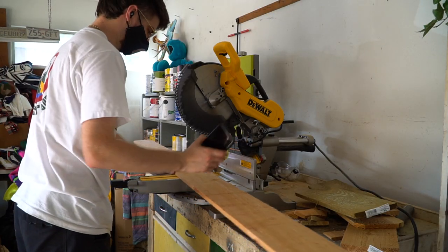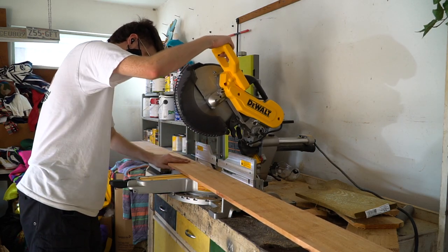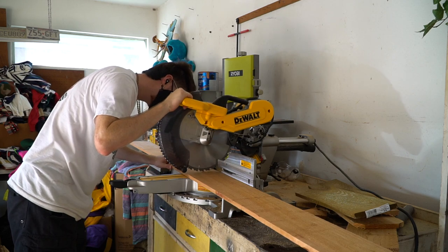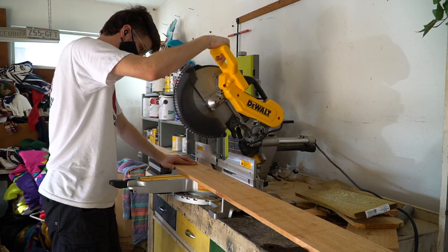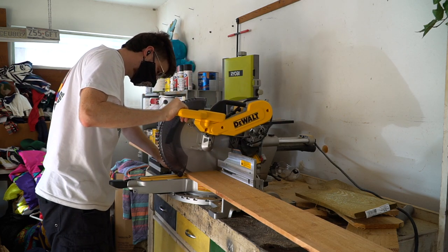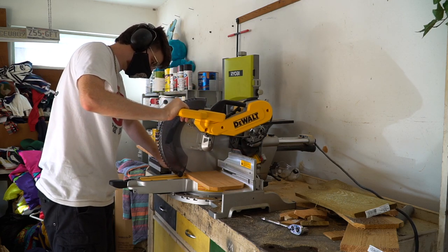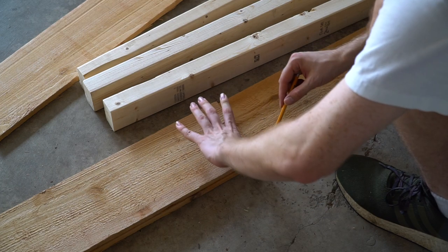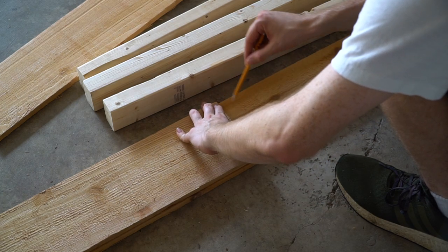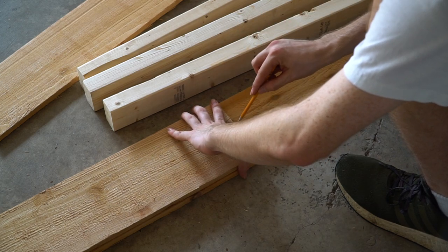To complete the size of the bin I bought some cedar fence planks that were non-treated and organic. I got two eight-footers at about five dollars a plank, and I got two 42-inch long cuts out of each. Then I used a pencil to mark 42 inches on those eight-foot boards so I could go mass production mode and cut a ton of those fence planks.